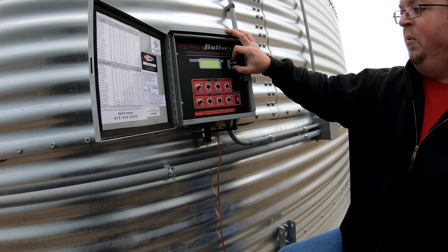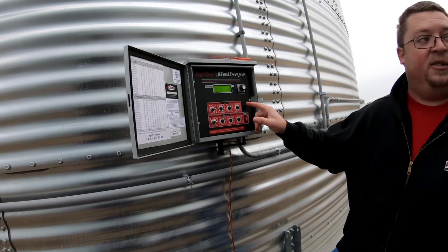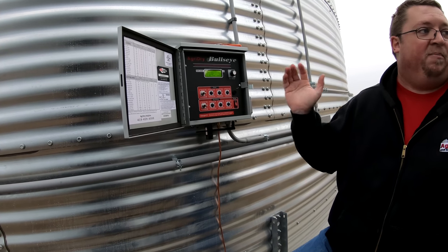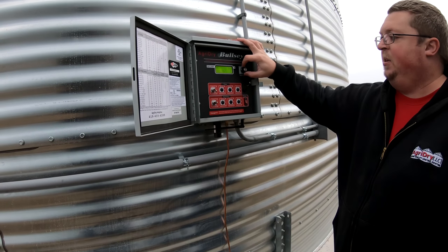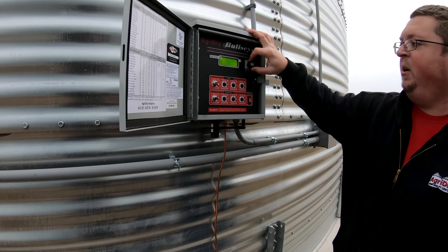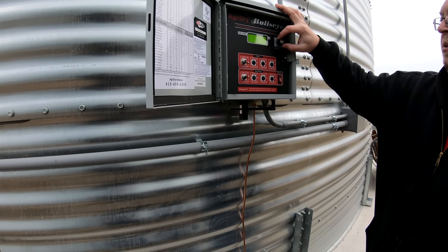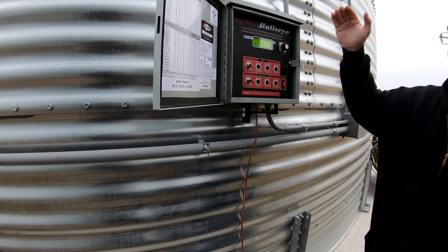Static pressure will let you know online whether the fan has run or is currently running. Fan status says on right now because I haven't reset it — there's a 30-minute cycle on these things, so if it turns on it runs 30 minutes; if it turns off it stays off. That way you don't have short cycling. Let me go to automatic and monkey with it just to make sure the automatic function works — I'll tell it we've got high moisture corn in here and crank this up to five, giving a five-point window plus or minus.